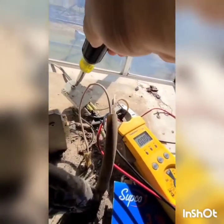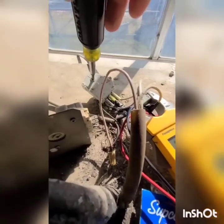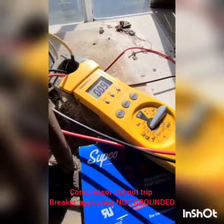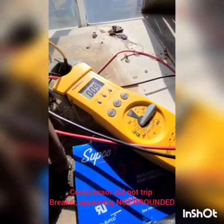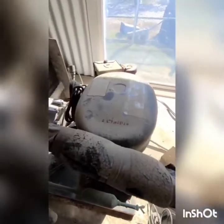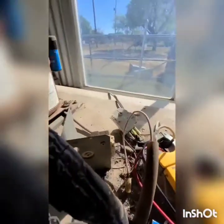I'm going to turn it out of freeze — quarter turn right out of freeze. This thing has ten clicks in defrost, so I'm going to click it and see the startup amp, see if the compressor starts up. It did not start up. Regardless, it still needed a capacitor so I'm going to leave that one in there. There's probably a burned wire in the starting area. I'll put it back in defrost and start taking apart the relay area.